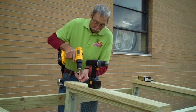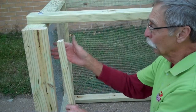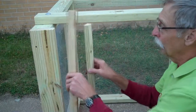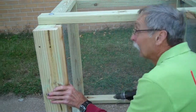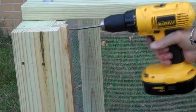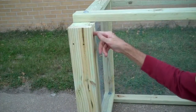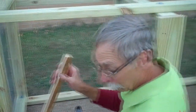All we need to do is find some material to put in our compost bin. The final piece to install will be the inside runner for the slats — this is trim off from the boards on the ends, and I cut two additional pieces, each one inch thick, which is just the dimension we need. I put it up against the frame, drill my pilot hole, install my screws, pull my spacer out, and I have a one inch wide space to drop our cedar slats in. We'll just work our way down and have all these installed in just a second.